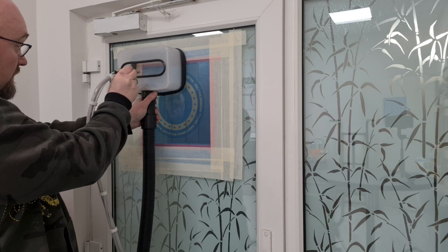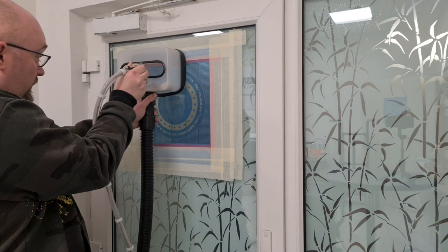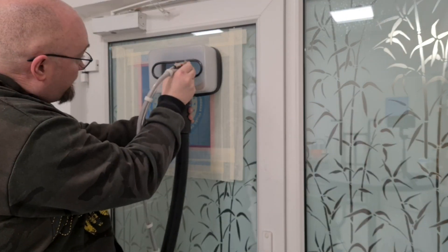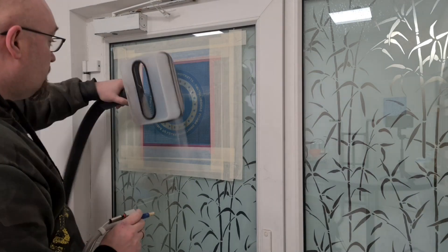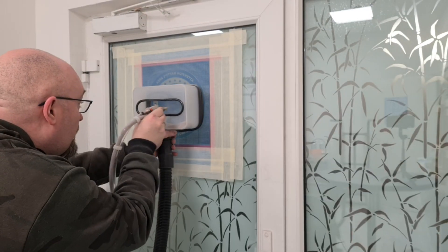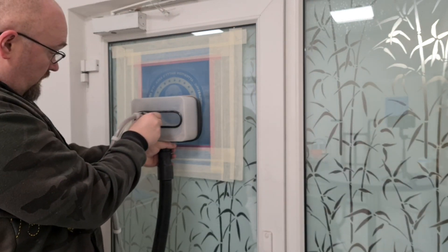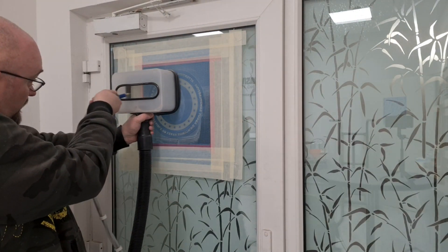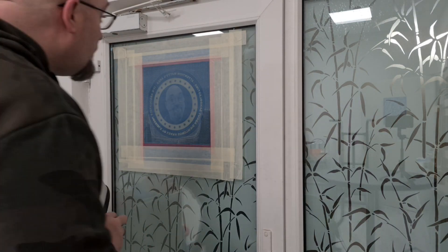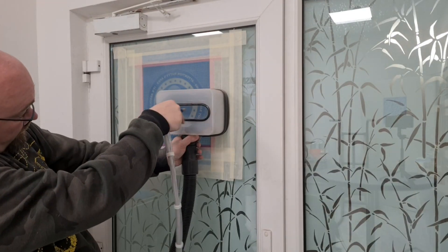You can wear a protection mask additionally, but here you can see that no dust comes out. The abrasive falls right on the floor. You can collect the abrasive with a cyclone — for example, a cyclone between the vacuum cleaner and the CB2 blast box. It's very easy to use, and you can also correct parts which you didn't sandblast well enough. The membrane of the CB2 blast box is very soft, so it doesn't scratch the details of the glass.